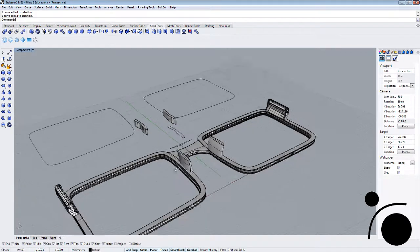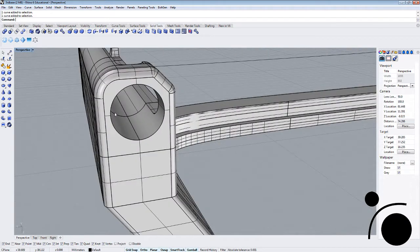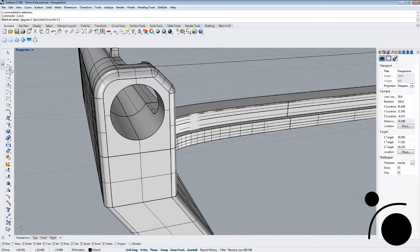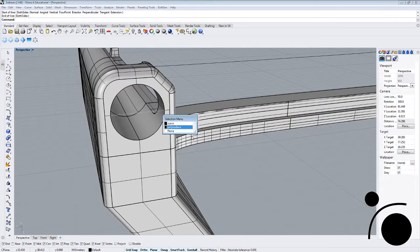So the first thing that needs to be done is these arm pivots need to be scaled to 1.6 across. That number right now is just being derived from what the solder I have lying around is. This goes really easy to manipulate, and then I can buy wire drawn to that same dimension. So I'm going to measure this first, and I do that in a little bit of a weird way. I'm going to go grab here to here, and then shift, so that's 1.5.